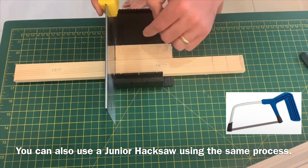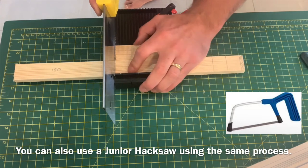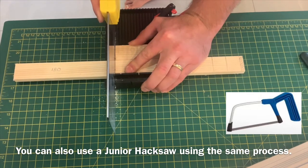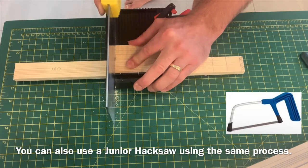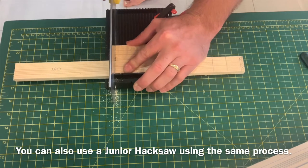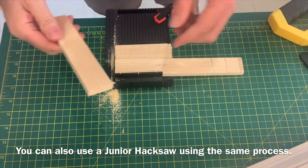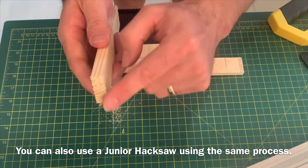This is a brand new saw so it might be a bit tough to use at first — make sure your fingers are here and your thumb is at the back away from the saw blade. Once they've got that path, get them to just gently push the saw back and forth. Pupils tend to just use the middle part of the saw, which takes a long time. You want to explain that the saw has got all those teeth for a reason — to use them all. So just lightly bring it back, don't dig with it, and lightly push it forward. And there is your cut at 90 degrees. There will be some wood split at the end, but we can get some sandpaper and sand that flat later.